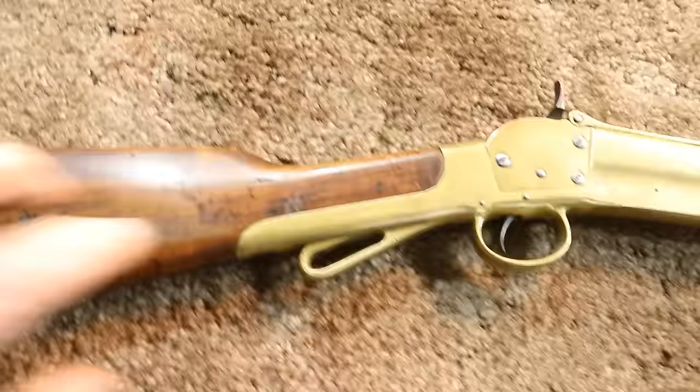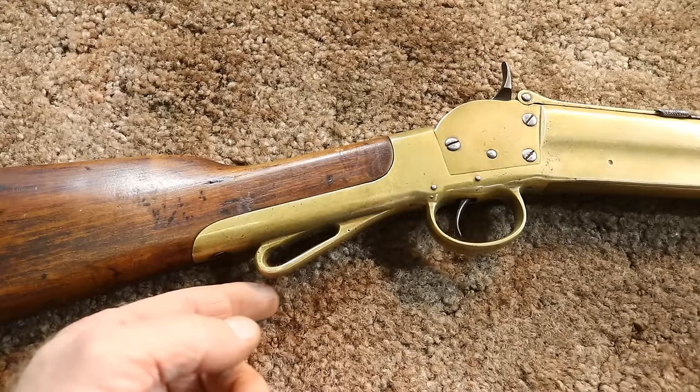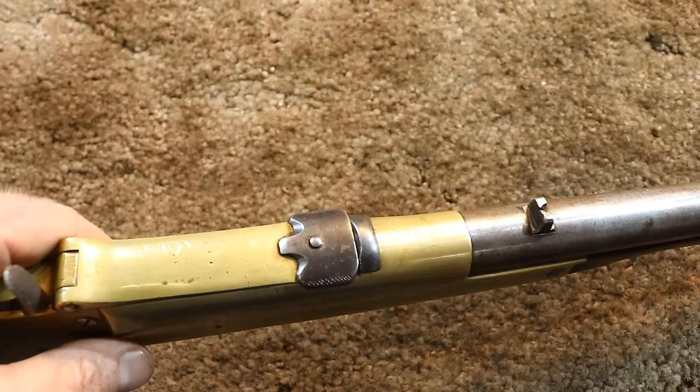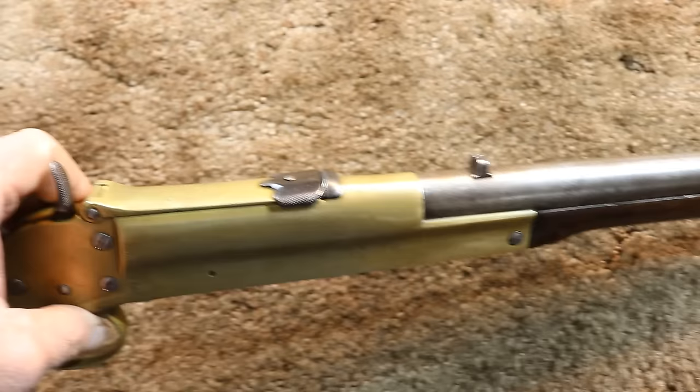Fairly interesting design here. Now, this looks like it would have kind of a dual purpose. It's almost a semi-pistol grip to hold on to, and also, for the troopers, they could use it as a sling ring and hang on to it. Of course, we saw the trap door. The hammer's offset to one side over here. This catch that we see on the front of this trap door wasn't on the early originals, and they added it later to help with keeping this thing closed when they fired the gun. Now there's another mechanism we'll see inside that helps with that as well.